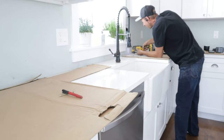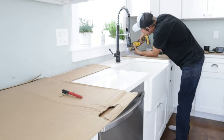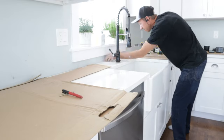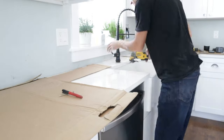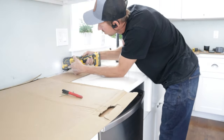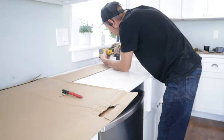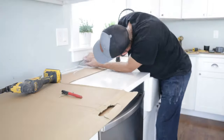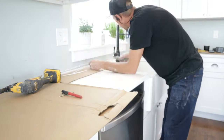Here I'm simply going to cut a notch for my low-volt wire. Since low-volt wire is not dangerous if you hit it, there are no restrictions on where you put it. Since I don't have tile on the wall yet, I'm just going to V-notch my sheetrock instead of cutting it completely off and going into the studs. I have blown insulation behind there and didn't want to deal with that, and I wanted to keep the fire barrier. So I'm simply V-notching enough space for the low-volt wire, and then tile will go on top to protect it.